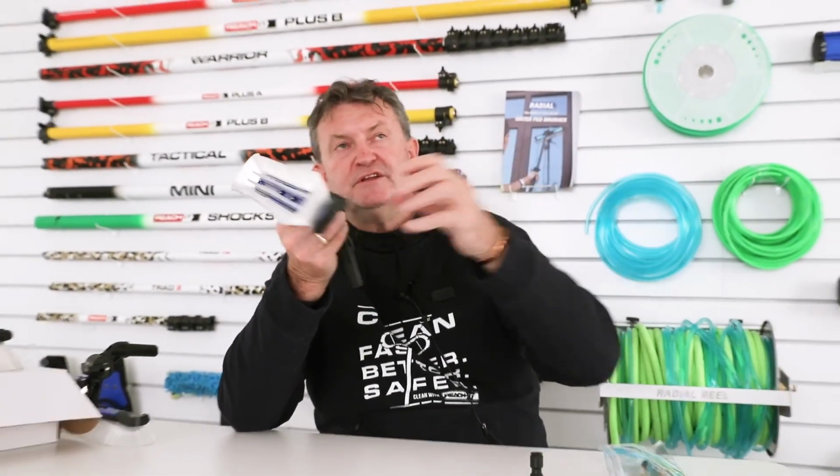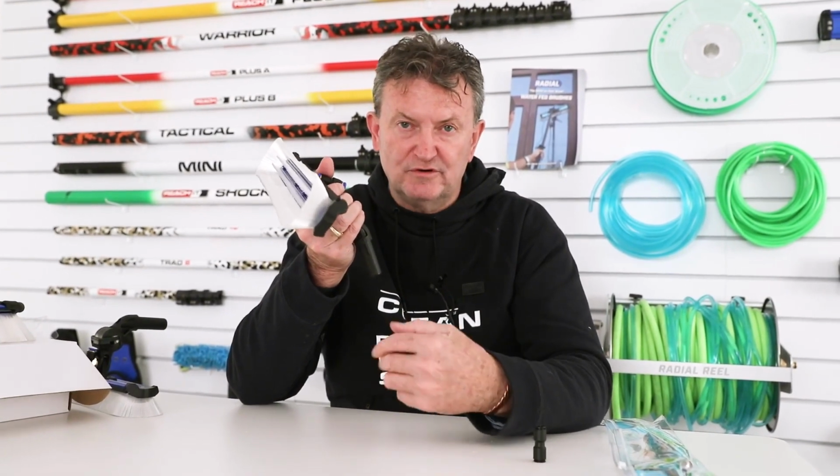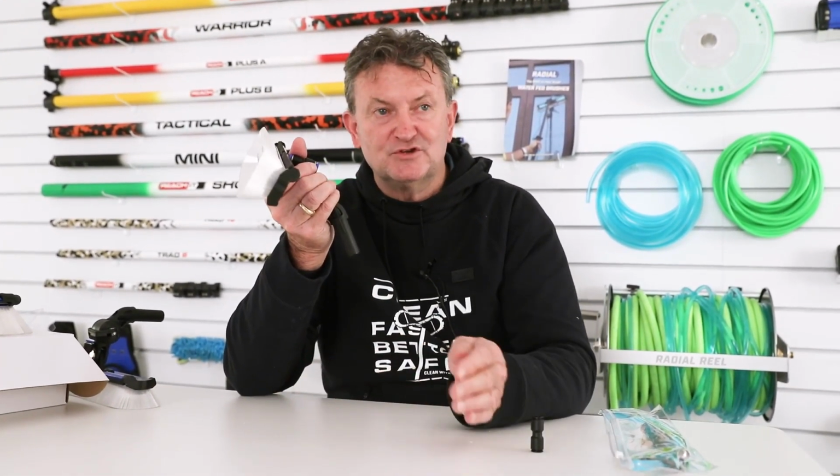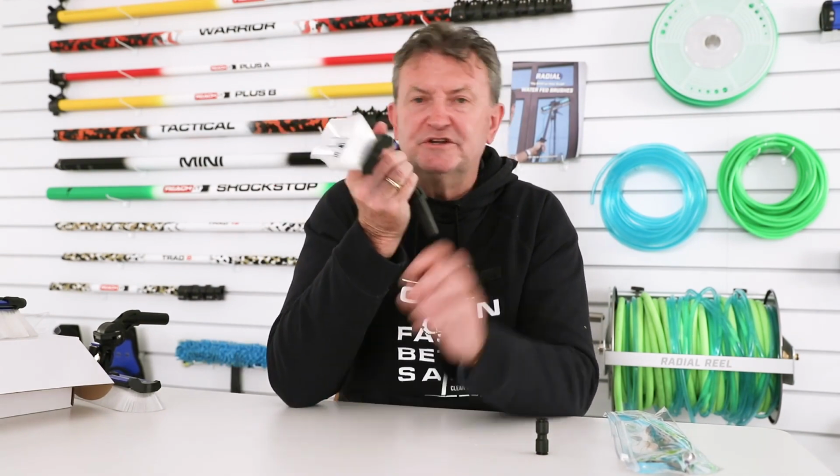So anybody who's typically a Reach It user would always get a high flow brush because your hydraulic system, your fluid dynamic system, is already set up for half gallon a minute, 2 liters per minute flow rate. So that means that you don't need to change it.